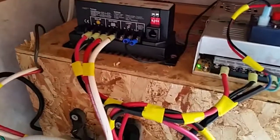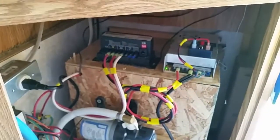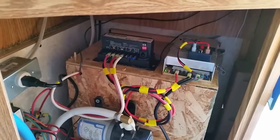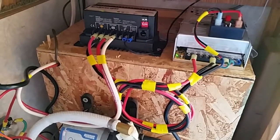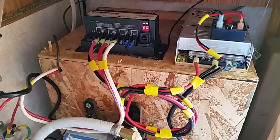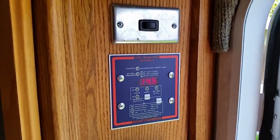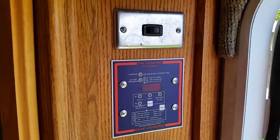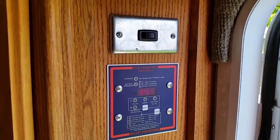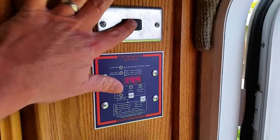One of the cool things about the Sun Saver is it comes with a jumper, and in the program setting you have two charging profiles — it depends on whether the jumper is in or out which profile it uses. I discovered the Sun Saver will switch programs kind of on the fly, so I removed the jumper and wired in a switch up here just above my Trimetric. This switch lets me choose between a profile that mimics a regular RV converter at around 14.4V holding for a couple of hours, then dropping down to 13.8V, or switching over to a full absorption voltage profile.